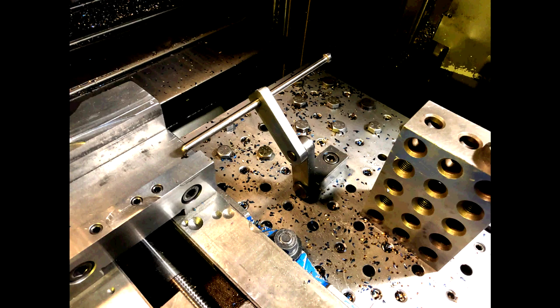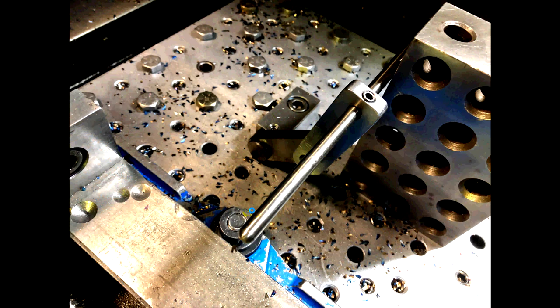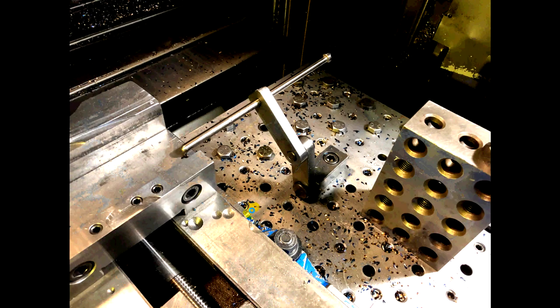There's my swing stop bolted to the table and a 2-4-6 block bolted to the table — you can just barely see the flange nut. I went right through the holes; these three holes go all the way through, bolted to the table. Then I slide the swing stop up to it, slide the part over until it touches, clamp both vices down, and then push the swing stop back so I can machine the part.